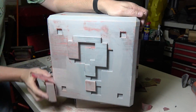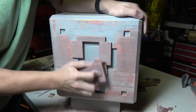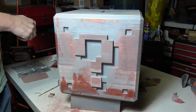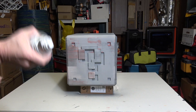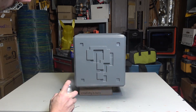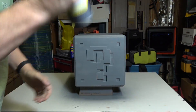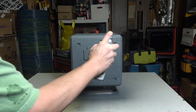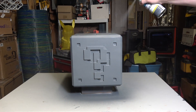Finally, once I was satisfied with the surface finish after the Bondo, the filler primer, and the air-drying putty, I sprayed it with a layer of regular primer just to finish the process and get it to a great place. Just like with the filler primer, I hit it with multiple coats of the regular primer because I believe that's the right thing to do.